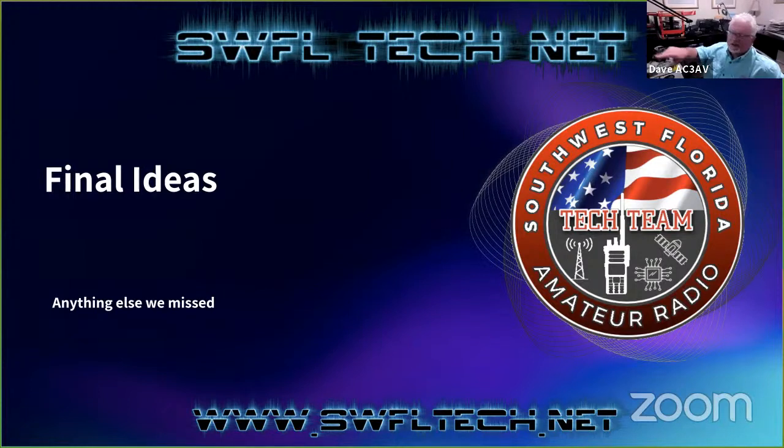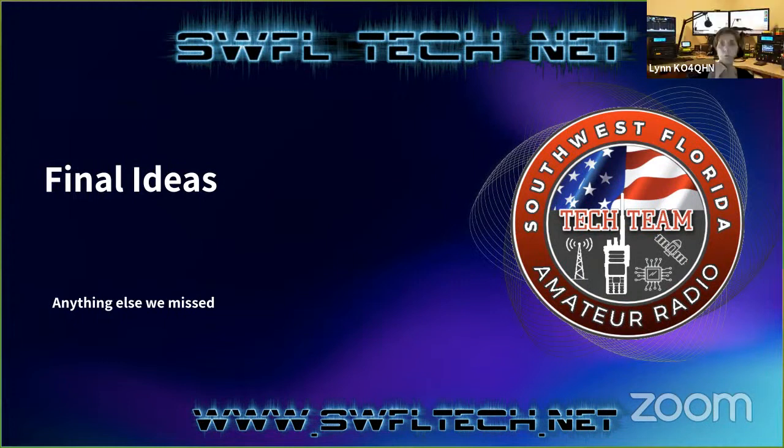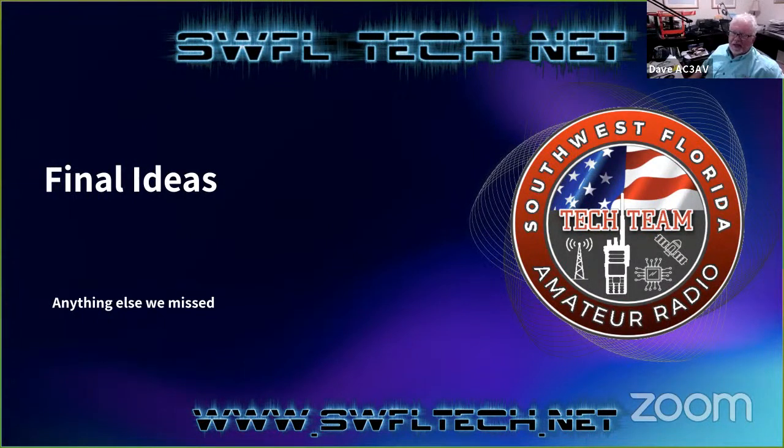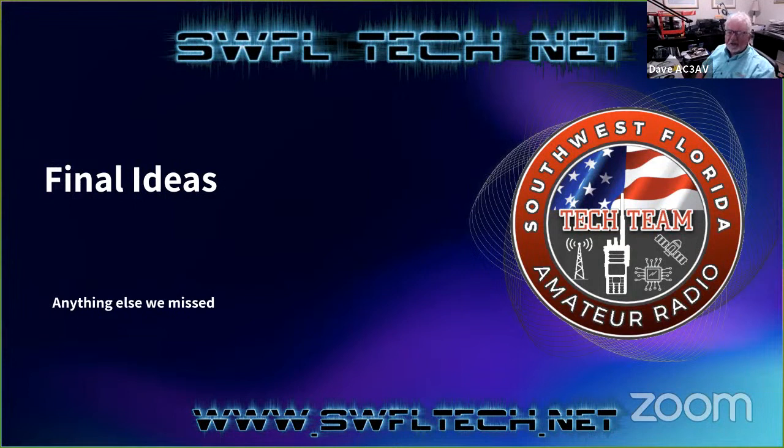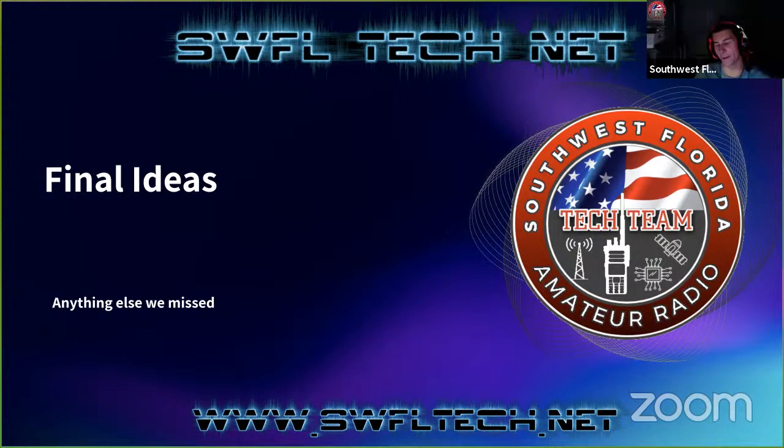Yeah, that's what I found with this SDR. I thought the SDRs were expensive, and I thought I could do the same with the cheap ones, but you can't, because the SDRplay, those are expensive, but they've got a bunch of bandpass filters in them, and they're switched as you go up and down. I got one of those little ones here, and the water board has been replacing all our meters around here, testing them and talking back to the office. I couldn't hear them at all on the SDRplay, but they were coming in on the little $27 SDR. Right through.